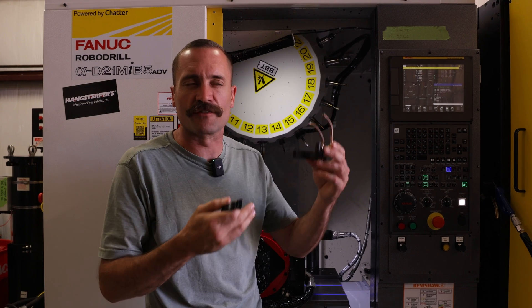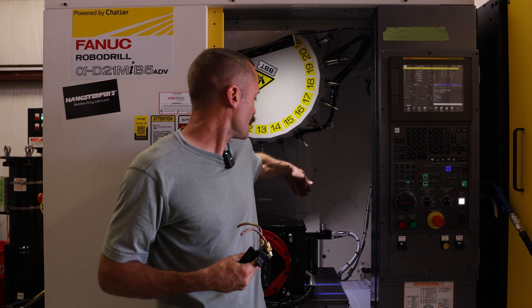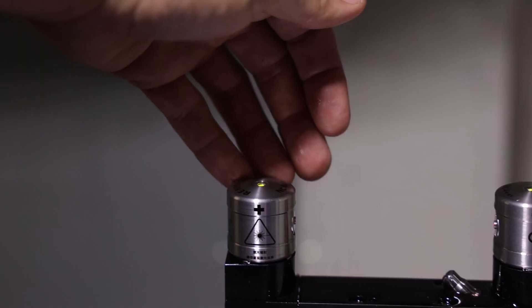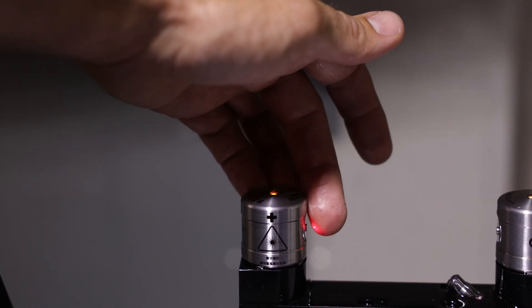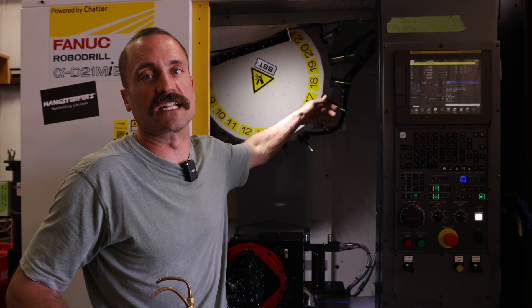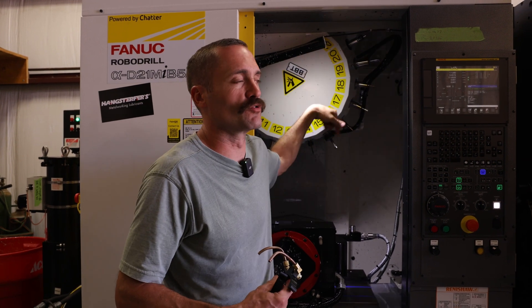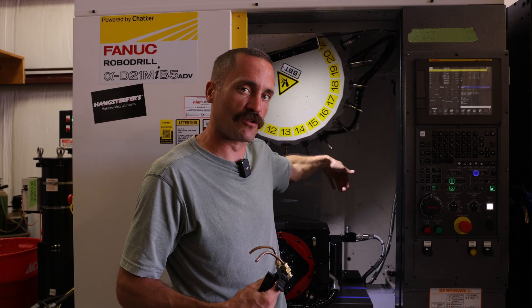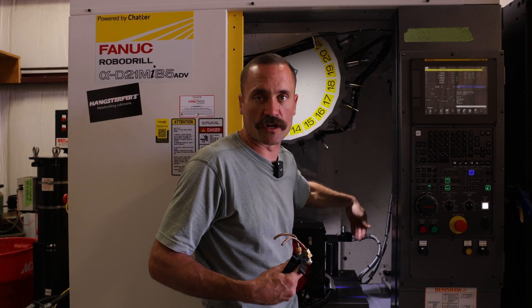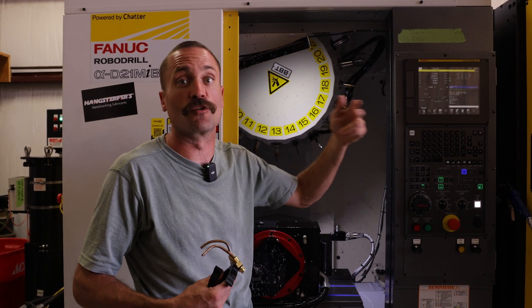Software, hardware fault — whatever the code is, I forget off the top of my head. But basically that's the whole thing: there's a chip on this laser. That laser goes from green to red, a chip is stuck there, and it doesn't allow the tool breakage detection macro through Renishaw to run. The tool gets done roughing, there's chips all over the laser, it goes to do a quick little tool breakage check and it can't because that laser beam isn't open.